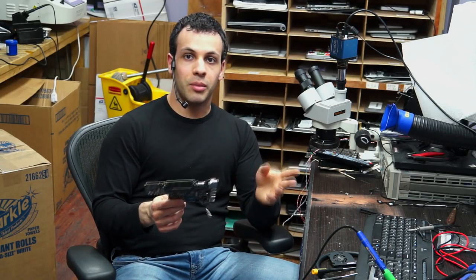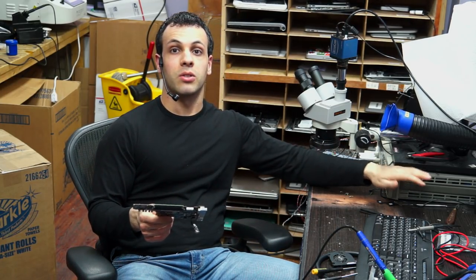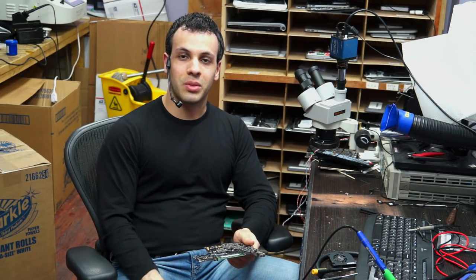Now, before I even got my short tester, this power supply that I use for finding shorts in a motherboard, you could see what I do with that in a previous video, how to find the short in a motherboard without a $6,000 camera. What I noticed is that my CPU heatsink was getting hot. Now, the thing is, the voltage was actually being brought down. The charger is kind of smart. If there's a short to ground, it's not going to keep trying to push 12 volts into it, it lowers it to 1.7. And at that 1.7 volts, my heatsink was getting hot, which meant that my CPU had something wrong with it.